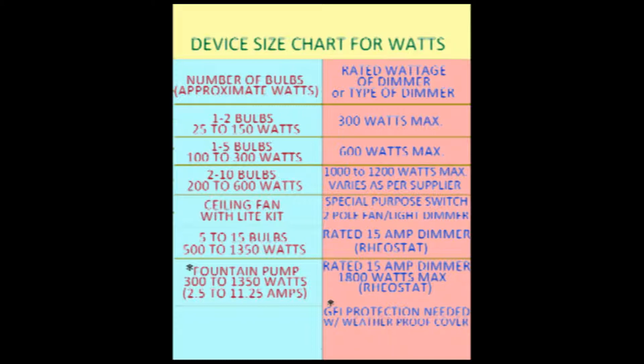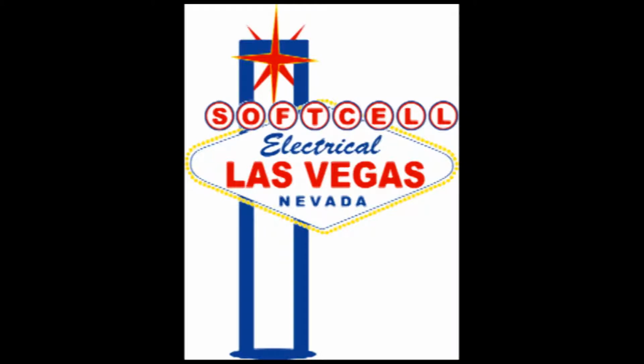Also know this: unlike regular toggle or rocker switches, dimmers put off a fair amount of heat. Many times my clients have remarked the dimmer plate is warm to touch. This is normal and poses no hazard. To summarize, use the chart to select the proper size dimmer, and when in doubt, get the higher rated dimmer. I hope this information has been useful to you, and remember to always turn the power off before installing any electrical device and read all the instructions.